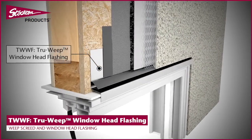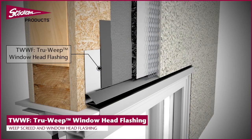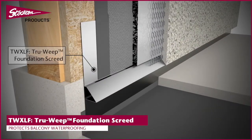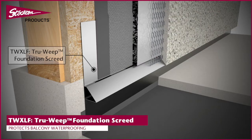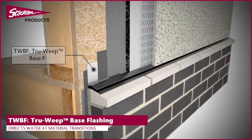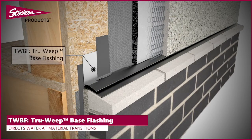Tru-Weep Window Head Flashing combines a weep screed with a window head flashing into a single-piece accessory. Tru-Weep Foundation Screed is a weep screed with a counter-flashing leg meant to redirect water while protecting balcony waterproofing. Tru-Weep Base Flashing is a weep screed with a counter-flashing leg to direct water away from dissimilar claddings such as stone veneer.